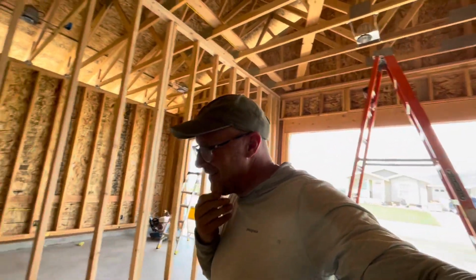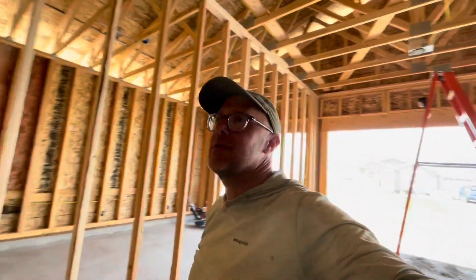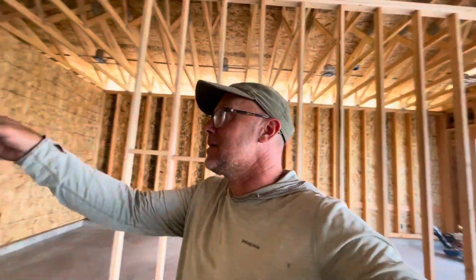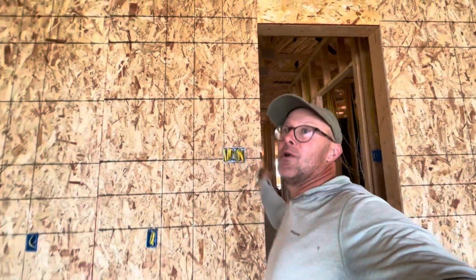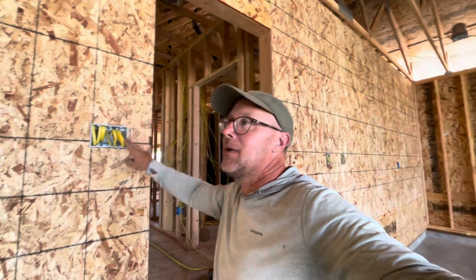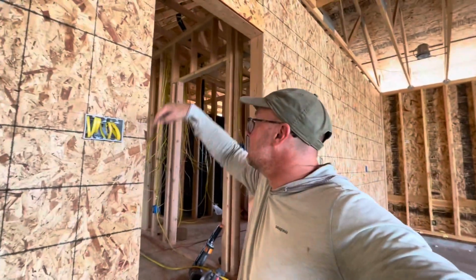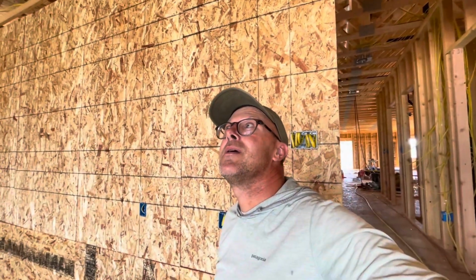I cannot believe I've gone through 3,000 feet of wire. And again, I don't have any weird runs like, why'd you run all the way here and then jump all the way there? I tried to anticipate these 3-way wires. I didn't run 12-2 all the way over there and then my 3-way back here. I ran 12-2 for 10, 15 feet, and then did 3-way over and then up. I tried to anticipate, okay, this is the shortest run, this is the shortest run.